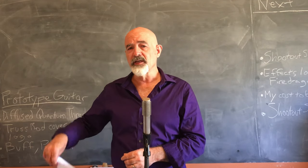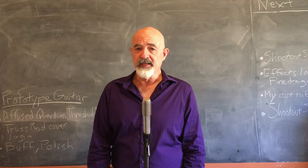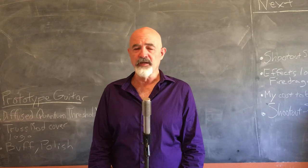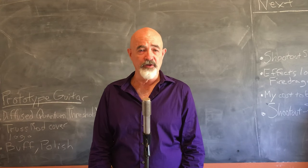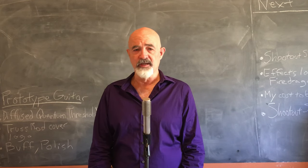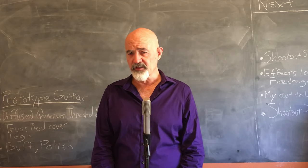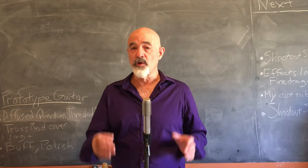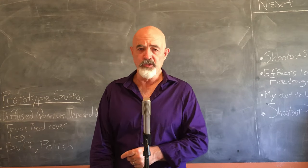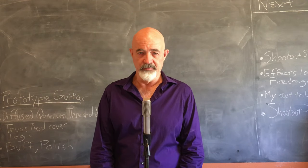So that's what I would do differently there. The other thing I would do differently, that tower and pulley system needs improvement. It doesn't move freely enough. In the future, the pulleys would have ball bearings, and I'd be looking for other ways to make it move more freely. I would also use a lighter counterweight, because as it was, I had to use my finger to hold the router down against the body while trying to rotate the guitar in the jig to get all the binding.